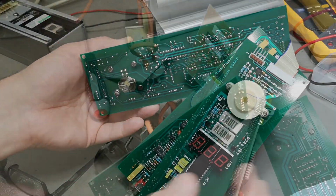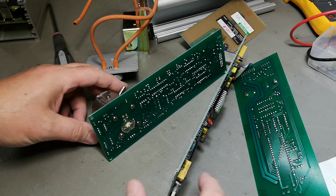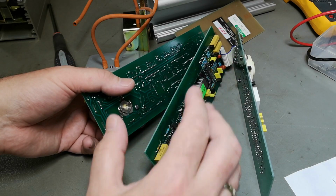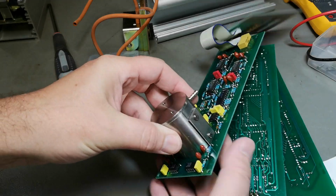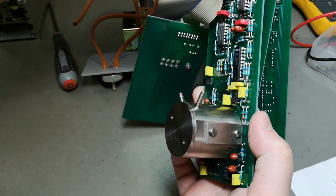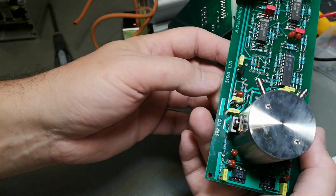Yeah, I've of course been able to Google this product and Google the sensor and all that kind of stuff. So yeah, I can actually tell you how it works. That is so cool. Yeah, so we got this AD converter and DA converter and the conversion table for making this accurate. And this is of course also how you digitally calibrate the whole thing. So this is of course the CO2 sensor, and the pump makes sure that the atmospheric air goes through the chamber and out again, so it's always filled with the right kind of air.